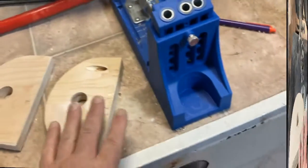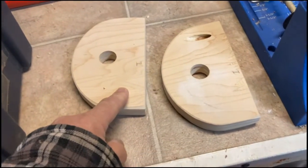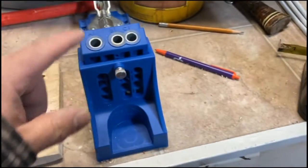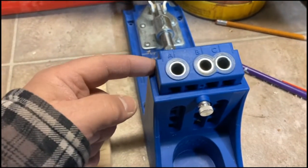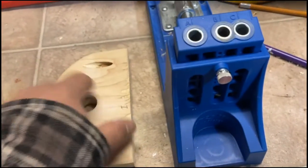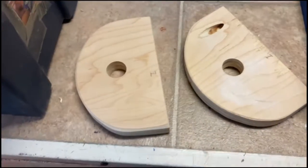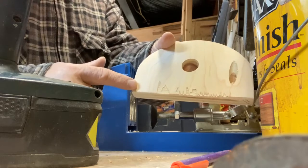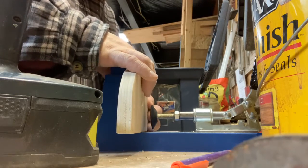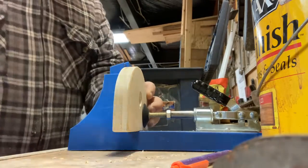For this part, to make it a little easier and look a little nicer, I'm doing some pocket holes into these pieces of wood that will hold the wooden dowel. I have to make sure the setting matches the depth of the wood. I've already done one — this is what it looks like — and I'll have to do another one here and two more on this piece. I'm lining the edge of this up with the opposite edge on this side to keep them equal distance. The only one who'll really see that will be me, but it's going to look nicer and be consistent.